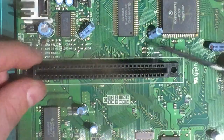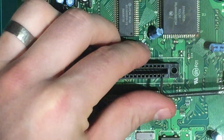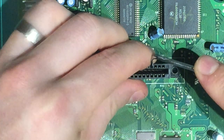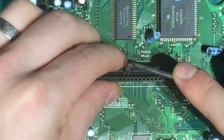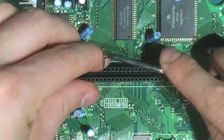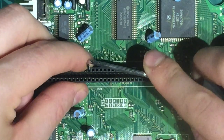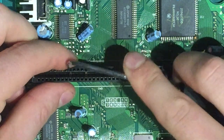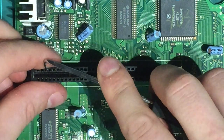You can't quite see the tops of the pins directly, but they've put holes in so you can still do the same sort of approach. Put your tool down - this side's easier - and you can still tweak them a little bit. That's all it takes, just a little tiny tweak to bend the metal. If you go too far, you can just easily flick it back - it's not too risky doing this process. A slight movement on the pin like that is enough to put a lot of pressure on the cartridge.